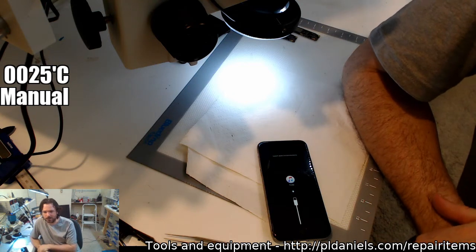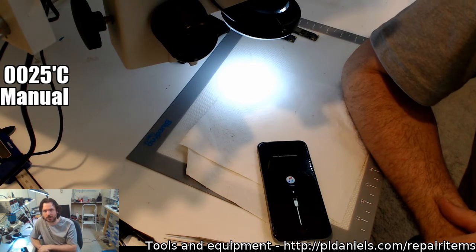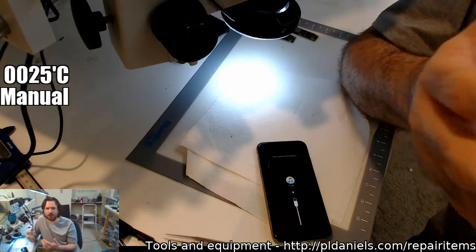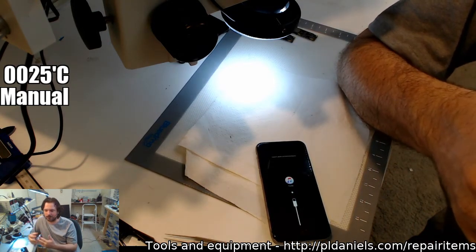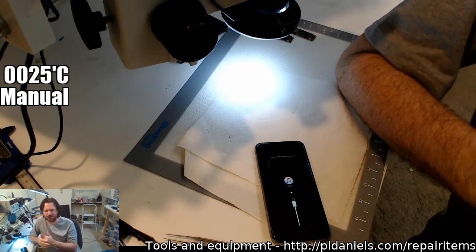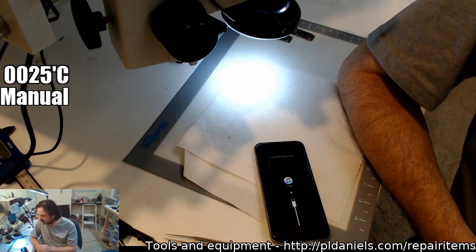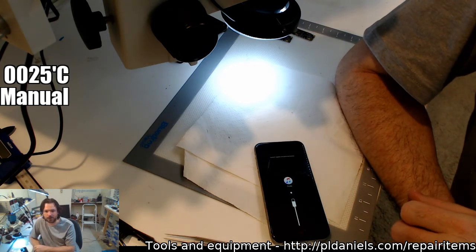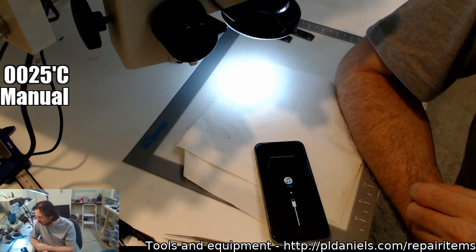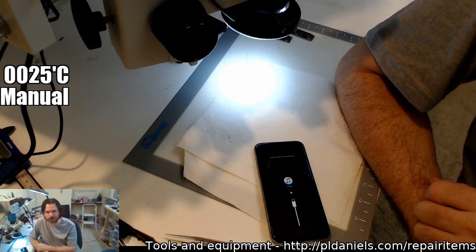It's the baseband PMIC. Okay. So it's not the baseband chip itself, it's just the PMIC? Because I was seeing a few videos ago that people were removing the baseband IC and fixing up, I think it was V1 and U1 balls. Is the battery in a good... Yeah, this battery is good. It's a fresh one that I've put in. And I was also doing this when I was running on the power supply. Are you suspecting maybe it went into the beloved Error 26 fault?